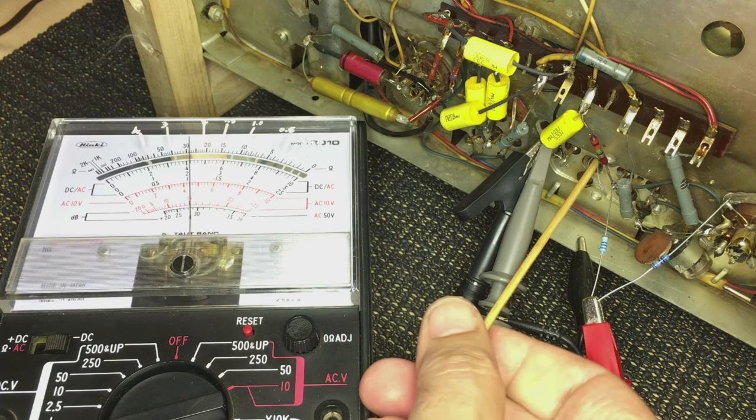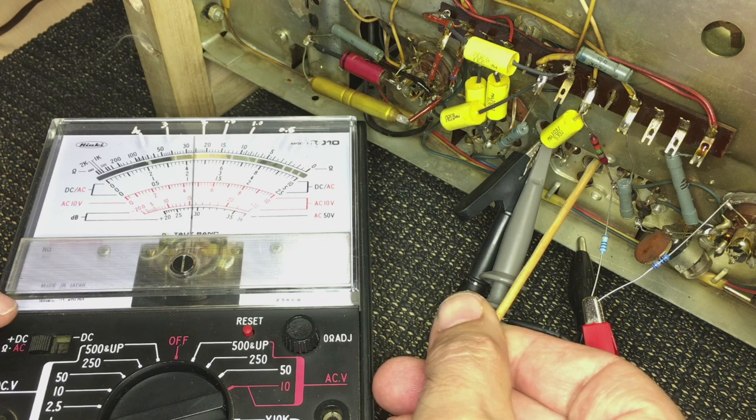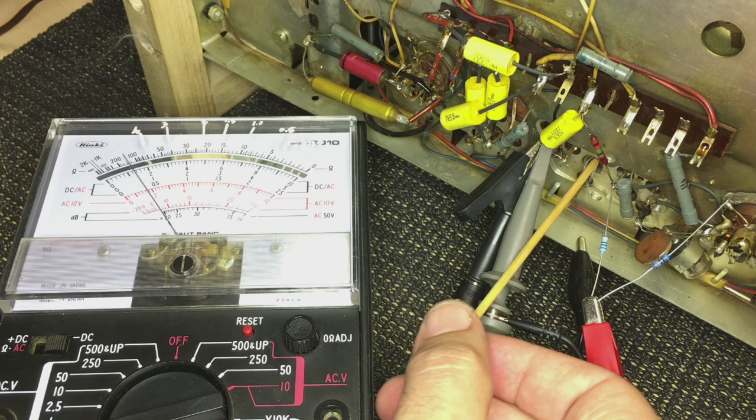And if I keep turning, but I'm going to make this negative DC, remember, you're measuring the reverse now, you get a peak on the other side. So what I need to do is go back and measure. Now you see it peaks the other way. So I'm going to set it to zero. And it's, again, very fiddly, but not that difficult.